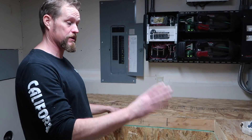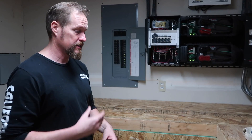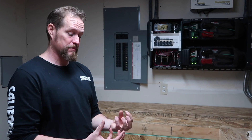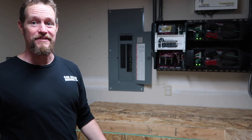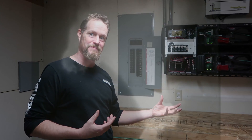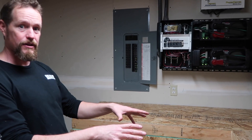With both of these batteries, as you charge them and they're storing electricity, one of the byproducts is off-gassing — they off-gas hydrogen. Both the lead acid and the nickel-iron do this as the electrolyte boils when you pump amperage into it. It splits the water — H2O — into oxygen and hydrogen. Oxygen is great, you breathe it. Hydrogen, though — think the Hindenburg blimp.